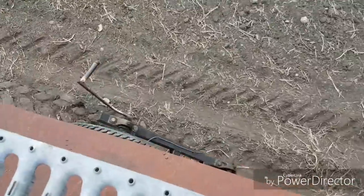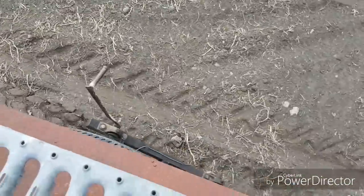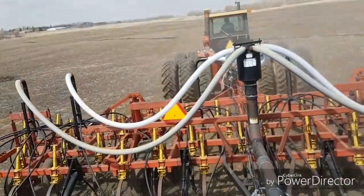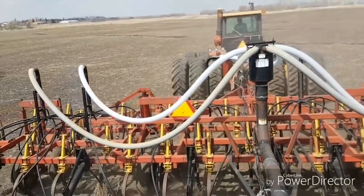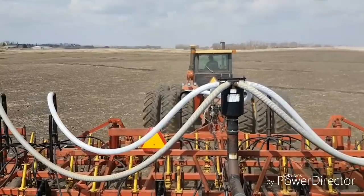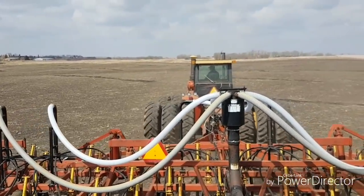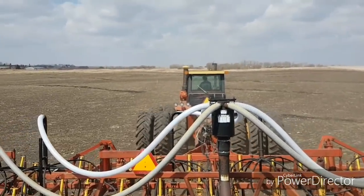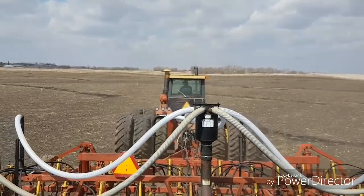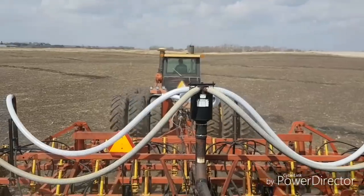we'll know if things are working. You can see the meter wheel running. It's calibrating on this 1,000 feet. It knows how far it's going. We told it how wide it is, and then it figures out how many rotations it made in 1,000 feet, and that's how it calibrates the size of the rotation on the tire, because I believe this is an acre in a line like this, so it knows how many cranks are in an acre, and that's how it knows how many acres we've done.